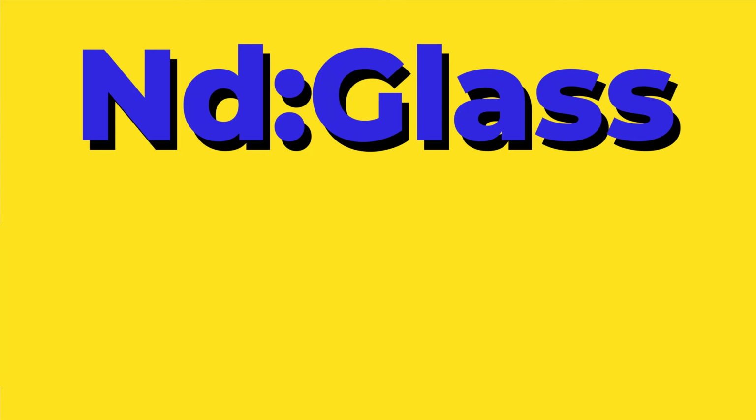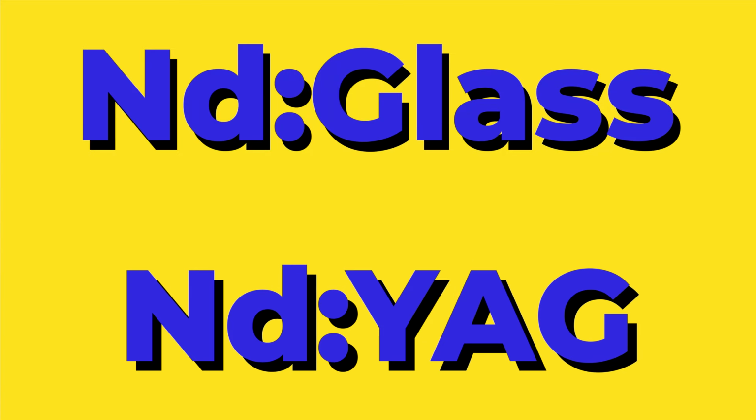Starting with the laser medium is a good choice, because without this, the whole thing just becomes a mediocre camera flash. As mentioned before, I went with the somewhat less common medium, ND glass. This is related to the more common ND YAG. The differences are somewhat not important in the context of this build, but they are interesting, so just for a bit of fun, let's dive in a few feet.